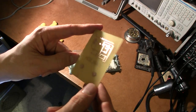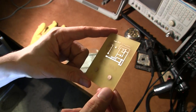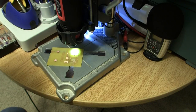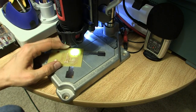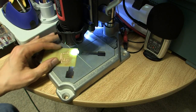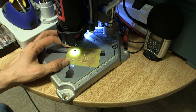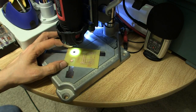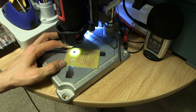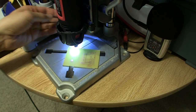I'm ready to drill the holes here. I've got my Dremel press and underneath it is a little white LED light so that when I slide the board over it illuminates the holes in the circuit board. That way I can aim the bit for the little hole, which makes life quite a bit easier. I also have another light on the top that I can move into place.